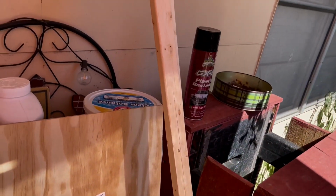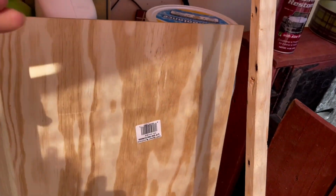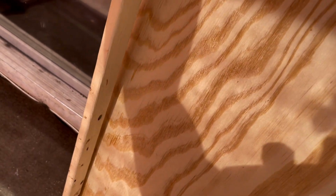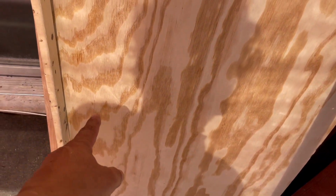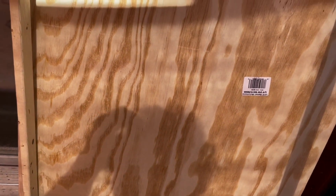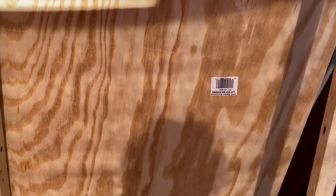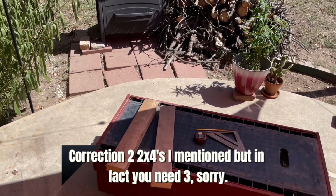And then these trim boards are basically going to go on the sides of the tabletop, which would be the plywood, kind of like this, to brace that as well. And then I might run one more from here, in the center, for support, for weight distribution for anything I might put on top of the plywood table, like a monitor or anything heavy for that matter. Anyway, I wanted to share that with you, because I did say earlier it was 3 2x4s. It's actually 4.